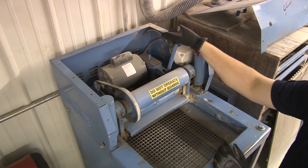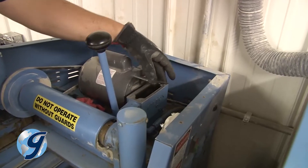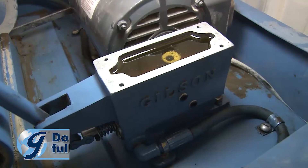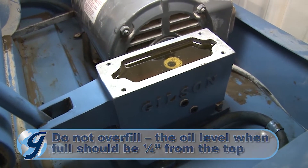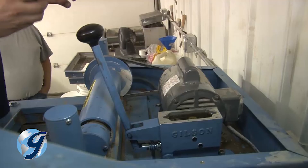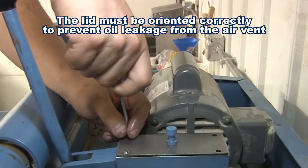Pull the pump handle to release the trays. Remove the pump cover again, noting its orientation as you did earlier. If necessary, refill any fluid needed to bring the pump reservoir to a quarter inch from the top. Next, reinstall the cover on the pump based on the alignment marks made earlier.